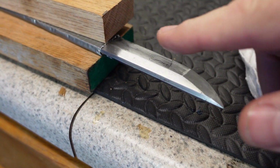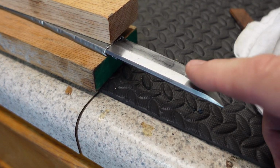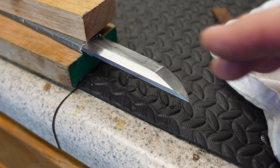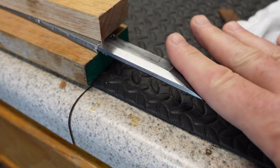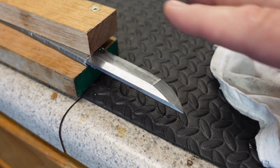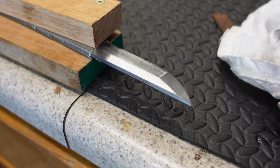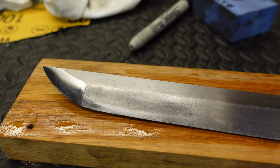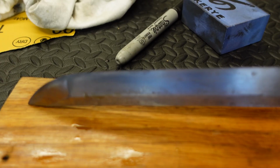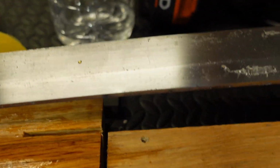And you have to polish the rest of the sword with the grain of the metal. We were able to shape the tip by coming down with various stones, but in the final polishing, it'll be more of this motion here, this motion here, and this motion here to keep these angles and keep the polish and the grain all aligned. The tip came out pretty good. I'd say we're pretty much done with this portion of the project here. Pretty happy with the way they came out. Got some more polishing to do along the whole thing.